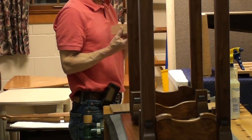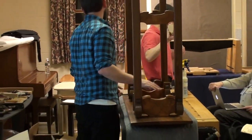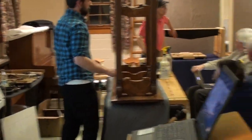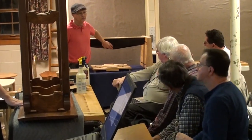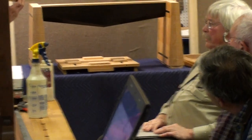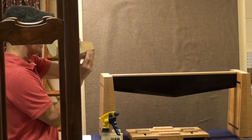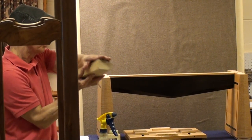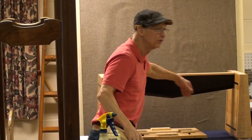No. I made a little mock-up here of a piece I'm going to show you. If you look over here, this piece is all iron-on, rolled-up veneer that I ebonized. It's just like this. So, started out on this facet, put a piece of veneer, and on this facet, then take a plane to it, and then you can put your other piece on. And so, we got this.